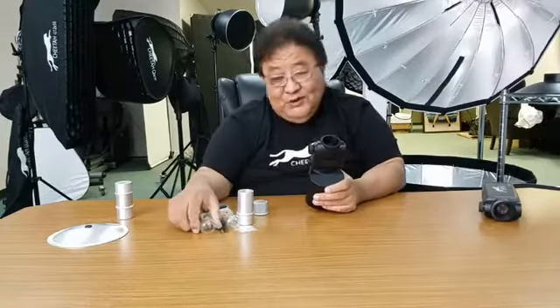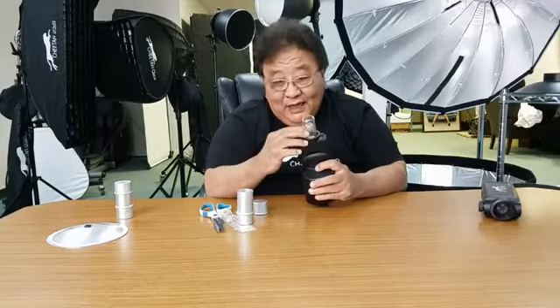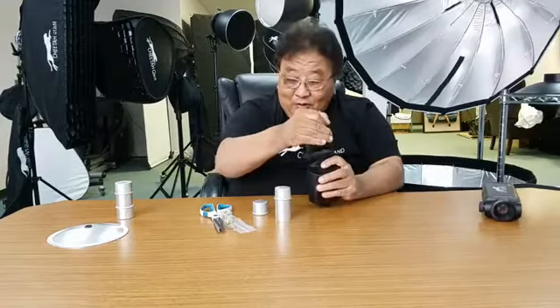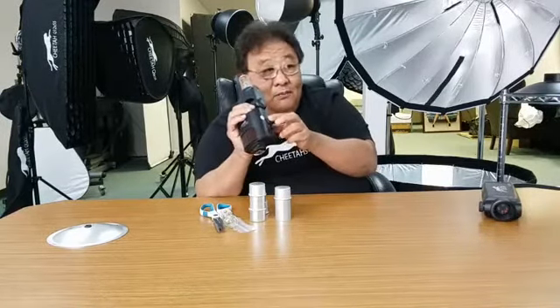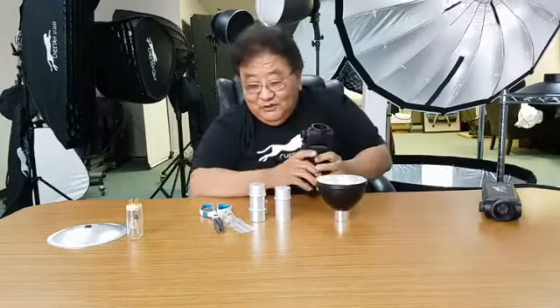The reason I do not do the 360 anymore — Godox still makes it — is that too many things can go wrong. First, if you did not push the bulb in firmly and you try to use the standard 5-inch reflector to travel, it will cause things to come loose. That's why I highly recommend when you travel, use this protector. When you're not traveling, take it out and put a protection tube. So many things can go wrong whenever these are the contact parts. Make sure you don't plug in and plug out repeatedly. The power cord is the same — some people plug in and take it out constantly. I don't trust those things; that's why I say don't travel with the 360. If you want to travel, travel with the 200X.